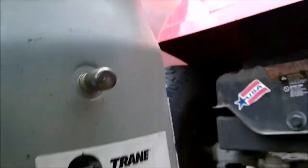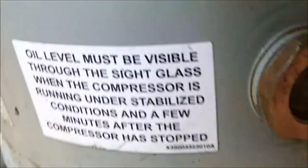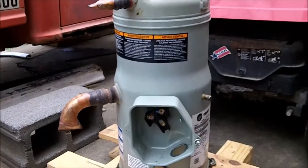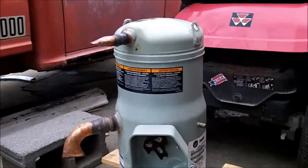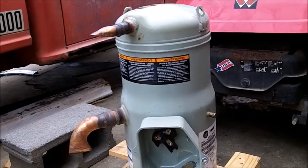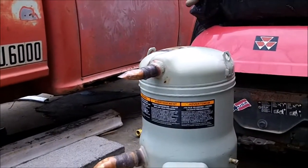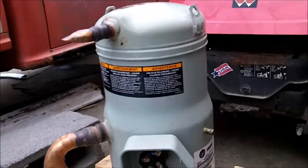There's no oil in it — you can tell on the sight glass there's nothing in there. I've tried powering it up. There's no way I can run this off 110 volts. I do have a Copeland compliance scroll, single phase, meant for 220 volts, but you can get away running it off a house outlet at 110 or 120 volts — it just pulls double the amps, so it still works, though it's down on power. But this one here — no way, sadly.